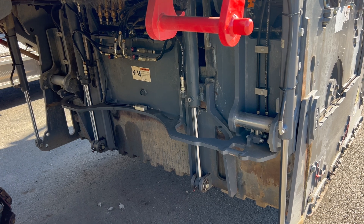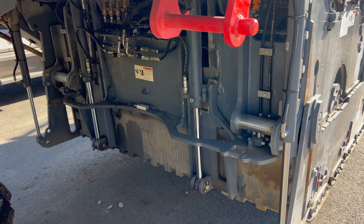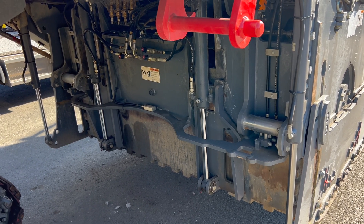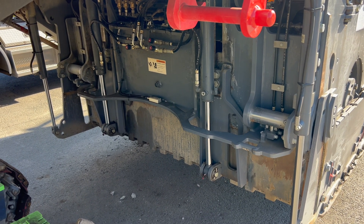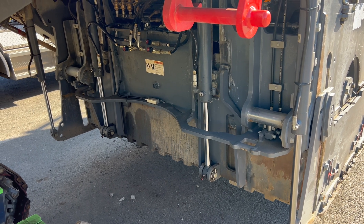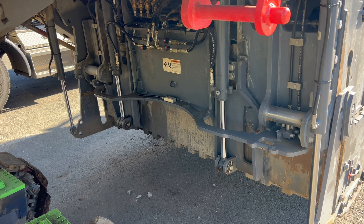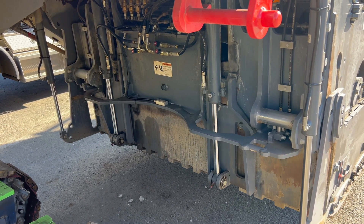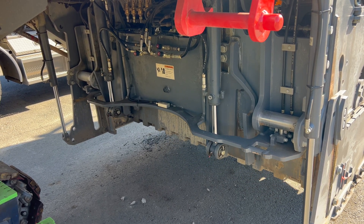That's the way you want it. What that's going to prevent is when you push the back door down going into a cut, it's not going to want to dig on one side as easily. You want it to go up and down evenly, so if you have to bump the back door up just a little bit, it's not going to unevenly raise from one side to the other. If you put it on float, it's going to float down more evenly — it's never going to be perfect, but it'll float down more evenly that way.